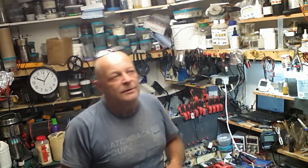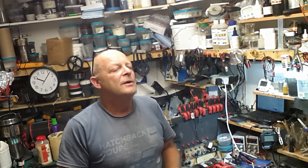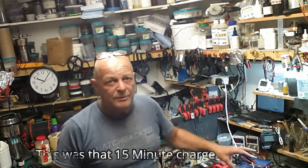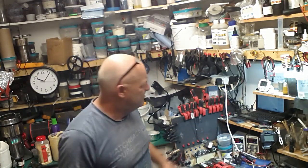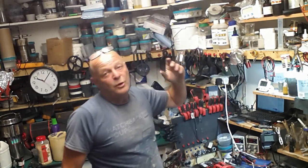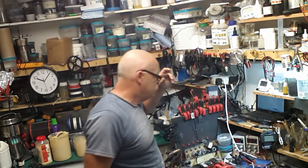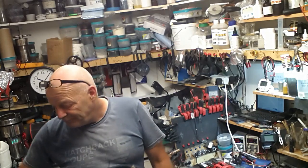What I'm going to do, because this is the first charge, obviously the battery needs to form a little bit. It's the same carbon, garlic carbon, as the previous battery. It's still running. It's 1 hour 58 now, 0.497 volts, 72 milliwatt hours, 59 milliamp hours. So I'm pleased with that.